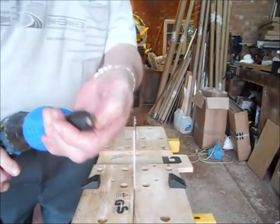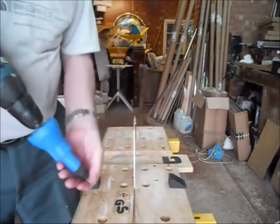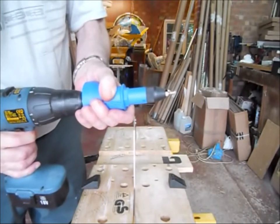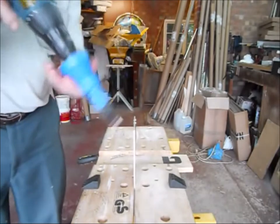There are a number of different sized nozzles for different rivets. Put the rivet in — if you don't want it to fall out, put the drill into forward drive and just move it gently until it grips the rivet. You can feel that now; it won't come out, so you can put it upside down.